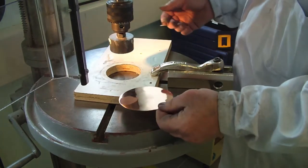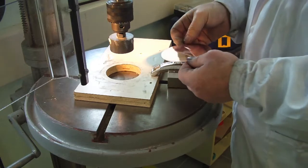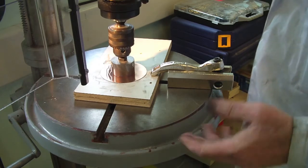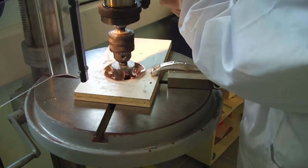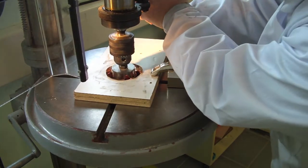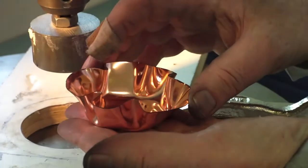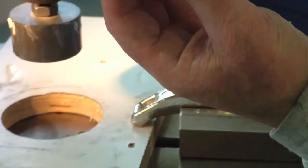We're going to try an experiment here. We've got a plunger and we've cut out a board, and we're using this heavy duty vertical drill as a press. We set our polished, annealed piece of copper in place — we've annealed it to make it soft. There's a central mark so we know we're coming down in the middle, and we simply press in. The result is a flat bottom which is nice and stable, with random wrinkling around the sides — quite effective.